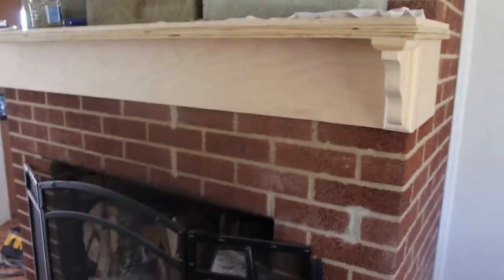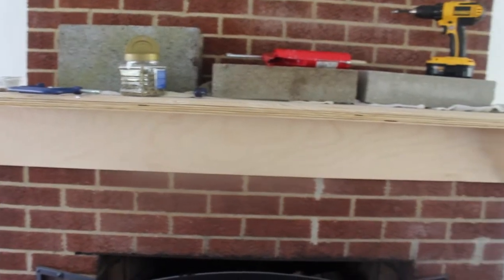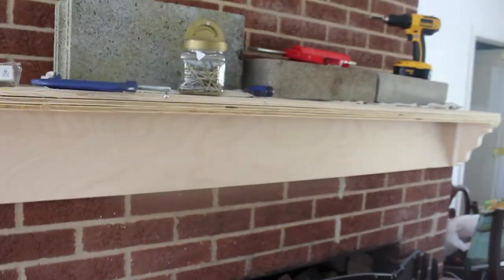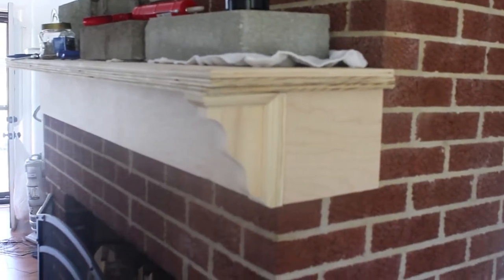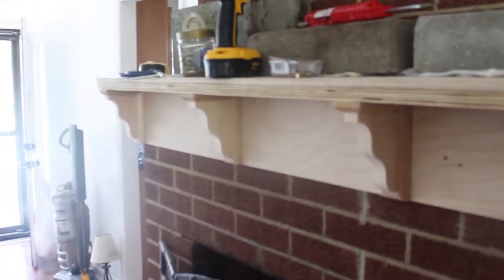We put that one corbel up just to make sure that everything was angled properly, which it was. Then we used some real high quality plywood for the fascia piece as well as the top piece so that we have a smooth and very secure portion that would actually show. We made sure there was enough plywood underneath for a really thick base, and we used construction grade adhesive to adhere the wood initially and then secured it all down with heavy concrete pavers.